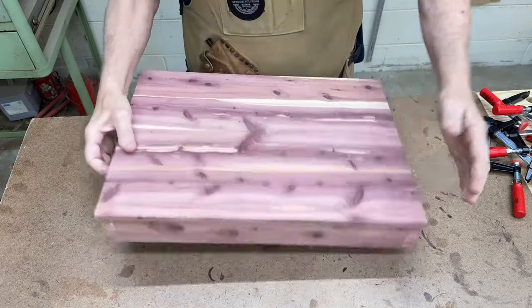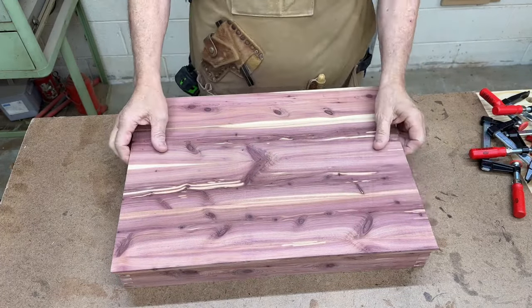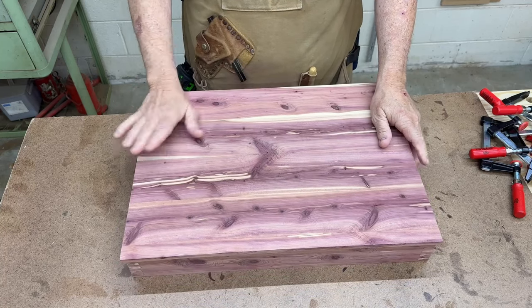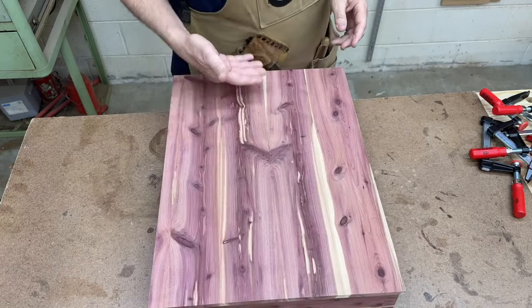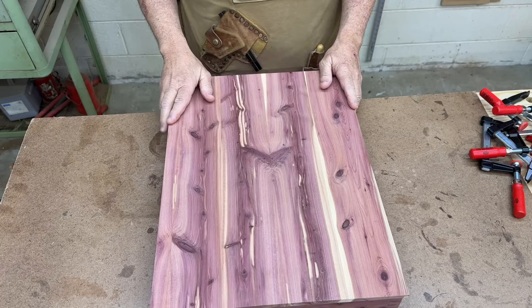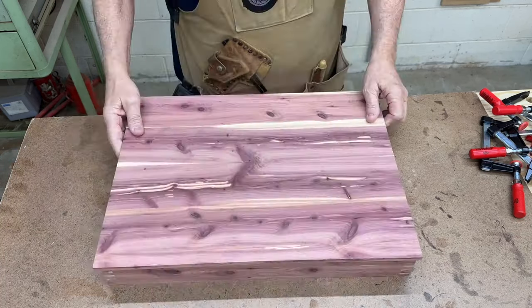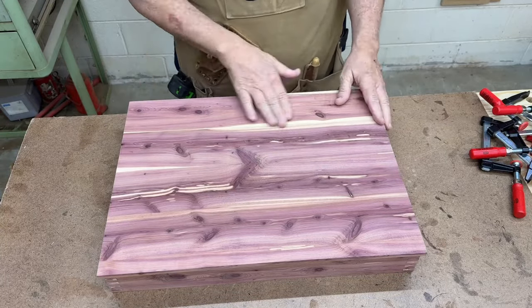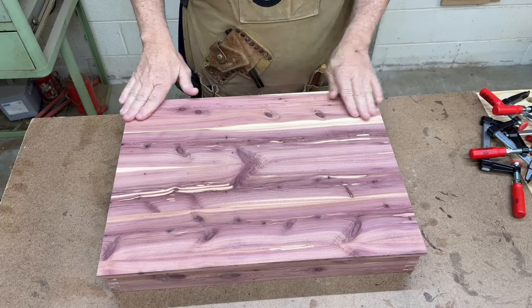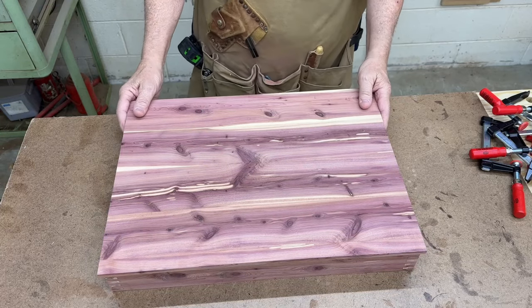And then what we'll probably wind up doing is a round over, if you know what I mean. And then this is the way it's going to set on the stove. It's running long ways. So then they'll put the vinyl on it. What I'm fixing to do is trim that down, flush trim it, round over. There's a little rough place right there. Sanding it down for the final time and start throwing the shellac to it.